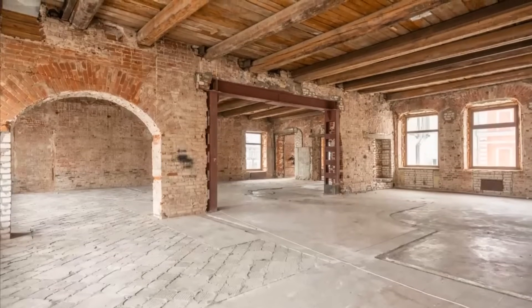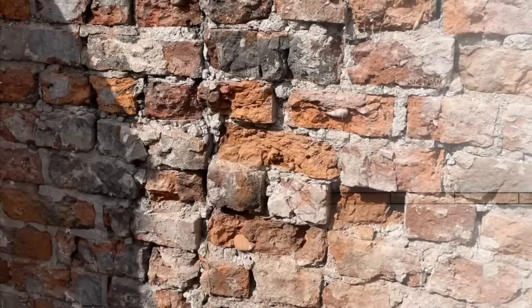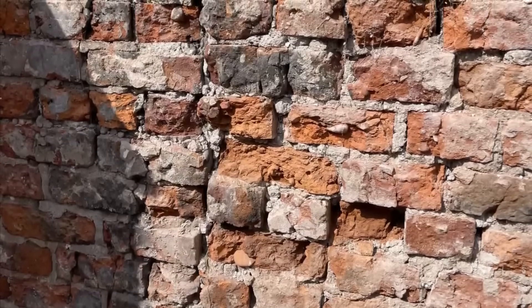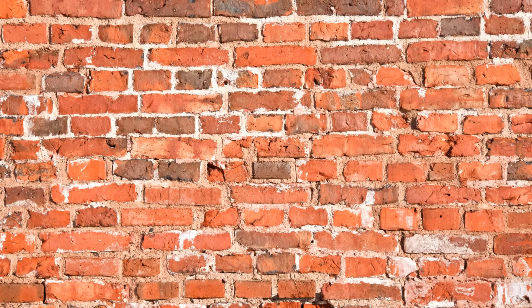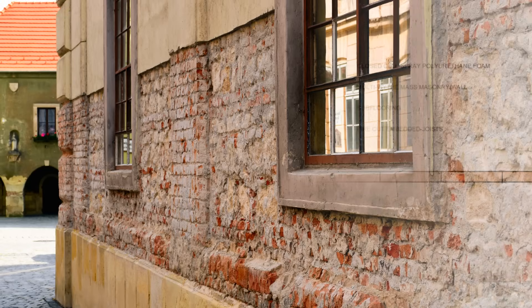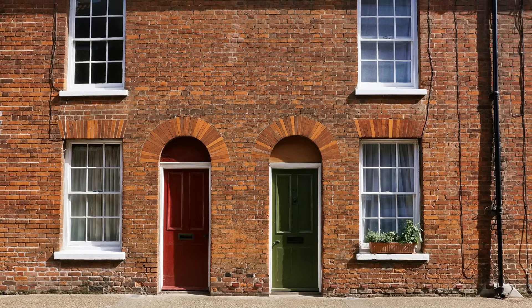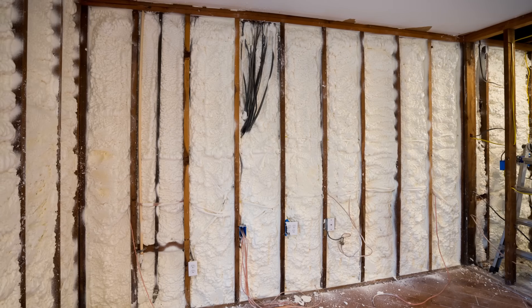You also have to be careful when you insulate old masonry walls, and spray foam adds some major complications. If you're insulating an old mass masonry wall in a cold, wet climate, you have to deal with the risk of freeze-thaw damage — spalling or crumbling of the masonry due to osmotic pressures created by subfluorescence or salt deposits left behind when water stored in the masonry freezes. By insulating with closed cell spray foam, the masonry walls stay colder since they're now thermally isolated from the interior, and they dry out more slowly because the closed cell foam is a vapor retarder — both of which increase the risk of freeze-thaw damage. This comes back to water management, but we can't always guarantee good water management when it comes to a mass wall that's designed to absorb and store water, so there's a lot of nuance when it comes to using spray foam.